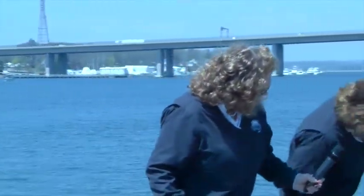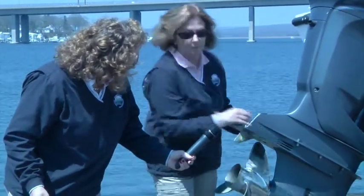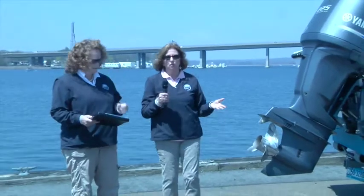So generally you're going to put the earmuffs here or here, and you can start it up, adding the water and then starting the engine up.